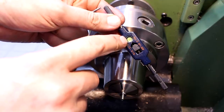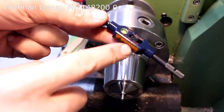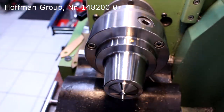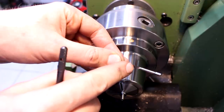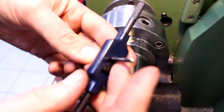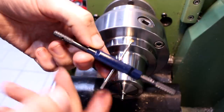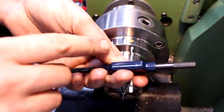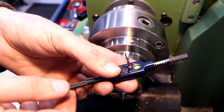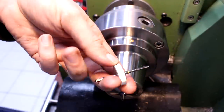If you need a little bit more torque, you can use a tapping handle like this. This one is made by Garant — sold via Garant in the Hoffmann catalog — and it has a small bubble level in it so you can tap level and straight down. On the tap, you grind two flats square to each other, which you can also freehand. This allows you to use a tapping handle and transfer a lot of torque. I use this to tap in titanium, which is notorious for taking quite a bit of torque. That's also why this tap has every other tooth removed — to reduce friction and tendency to seize up in the thread.